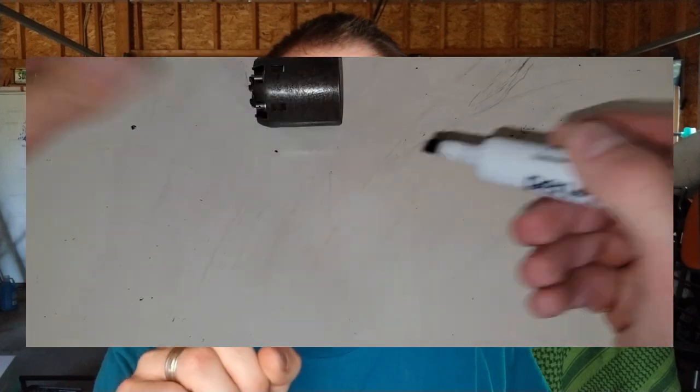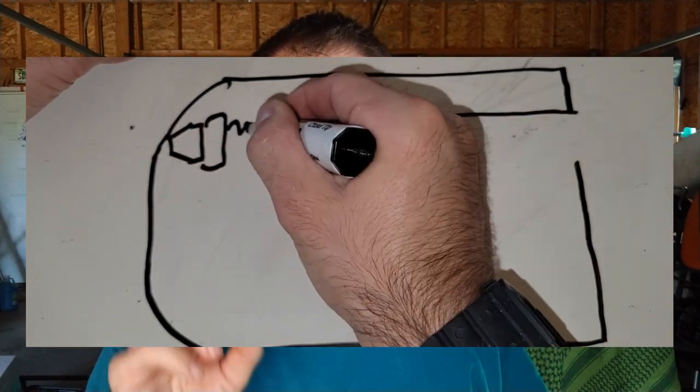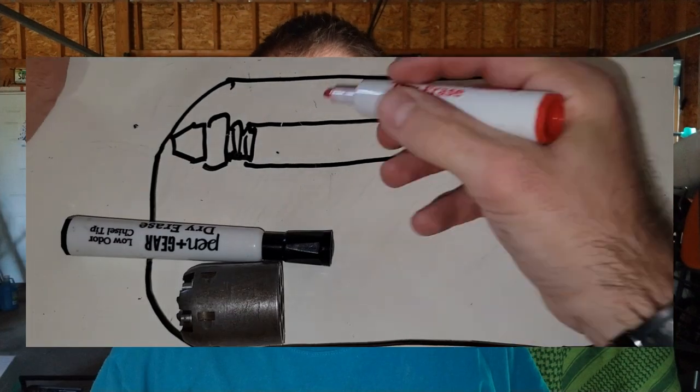What if I told you that you could cut that ring of lead and each of your round balls could still be undersized, leading to the risk of chain fire? The theory of cutting a ring of lead to ensure a proper seal relies on one big assumption: that Uberti or Pietta have both milled the cylinders properly. This assumes that the diameter of the rim of each of the chambers is the same diameter as the inside of the chamber itself. On my Pietta, I noticed at the range one day that I was having some delayed shots and some shots that just sounded different. When I glanced down at the cylinder, I could see that some of the round balls had worked their way to the front. I gave the revolver a little flick of the wrist and most of the round balls came all the way out of the cylinder. I had cut a ring of lead on every single one of these chambers — so what went wrong?